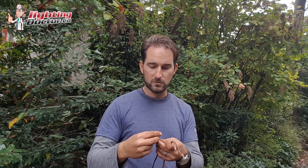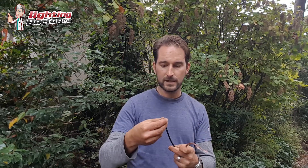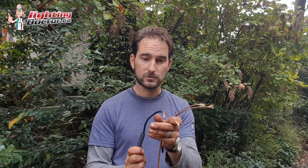I've got my wire to my fixture and I want to make that a lot longer so I can make my connections down in the ground. What I'm going to do is slide my tube on first because you need to get your tube on the wires before anything else. I cut one of them a little bit shorter than the other — basically so I can cheat and just use one connector as opposed to having to use two, since each fixture has two wires.